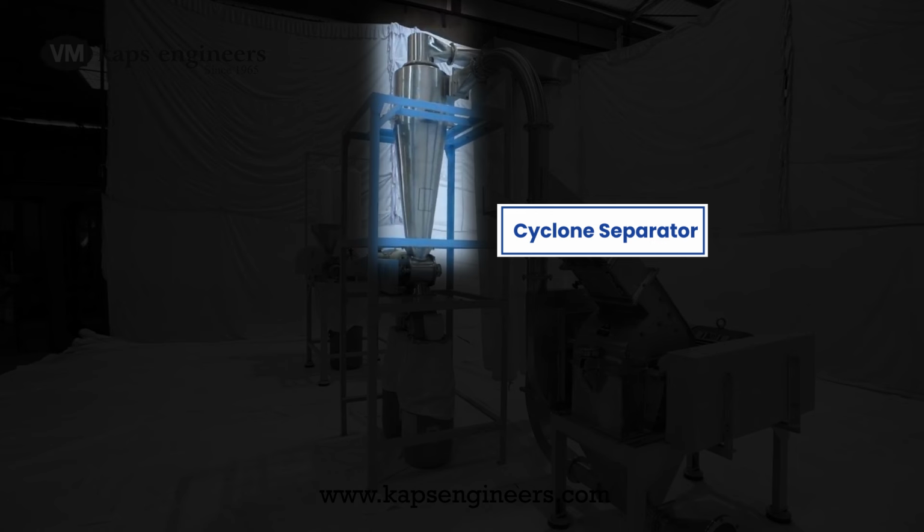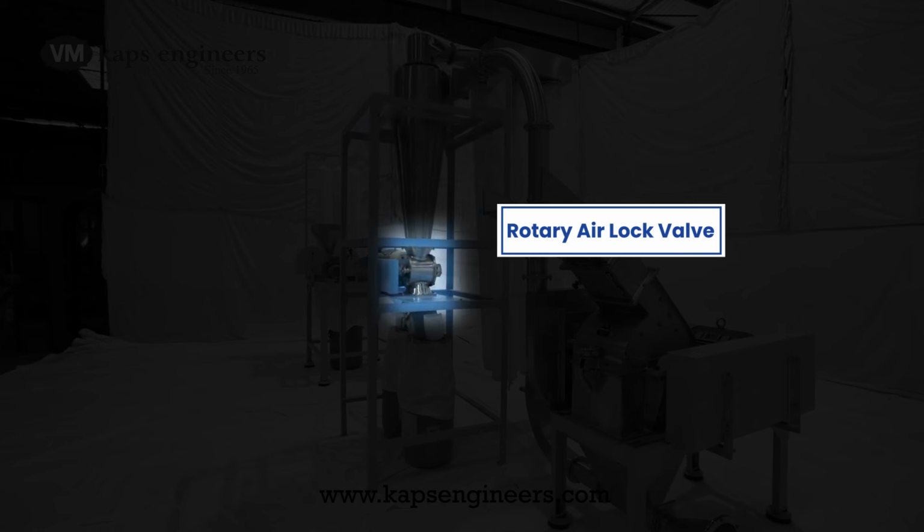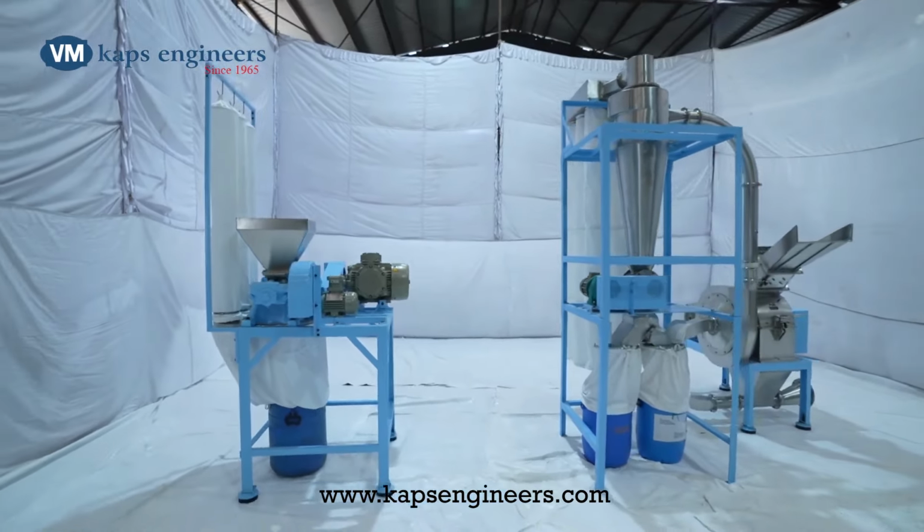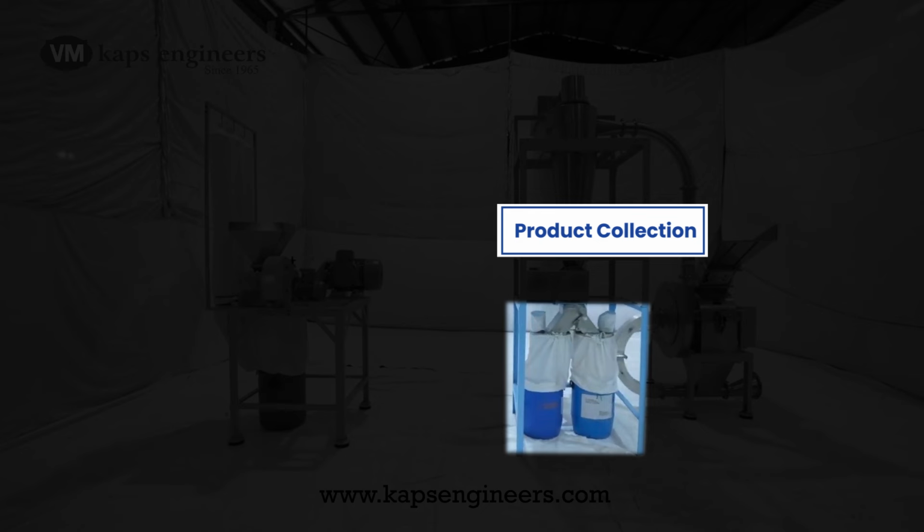Fine material is discharged to the rotary air lock valve, and air along with fine material goes to the dust collector. The role of the rotary air lock valve is to lock air and allow material to be collected in the drum continuously. The two-way connector allows the material to be collected in drums or bags continuously without stopping the machine.